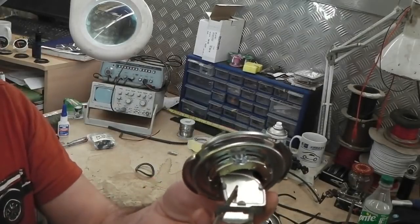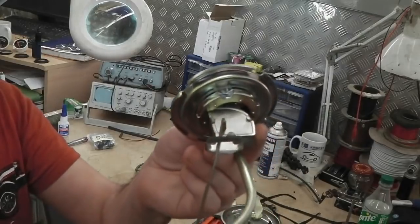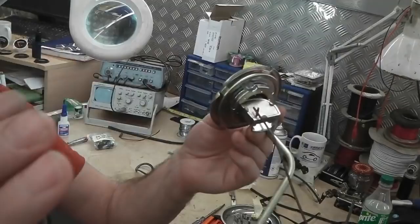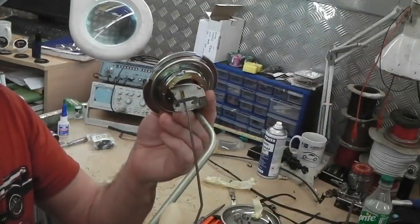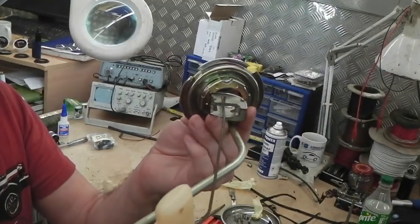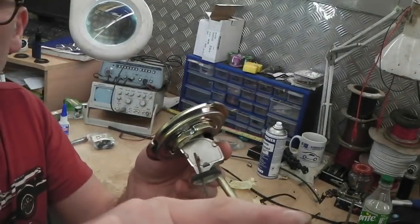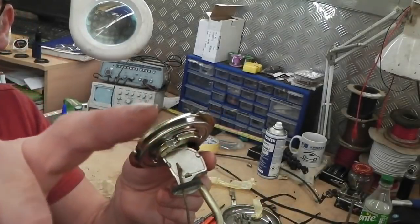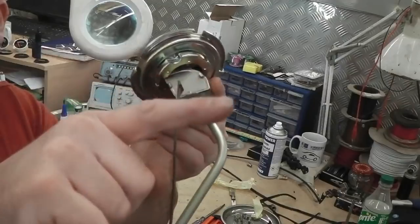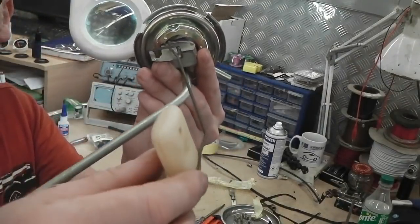It could be linear, that is that it's a gradual change of resistance as the float moves. If the tank's constructed parallel and there's not a sort of sculpted out bit of the tank that's got much less volume of petrol in it for the movement that you'd get, in which case this would become logarithmic. That is that it wouldn't be a gentle gradual change of the resistance here as that float moves. You would get a sudden fall up or fall down on the curve, and that's called logarithmic.